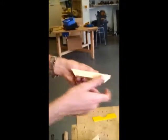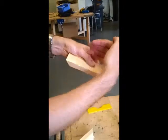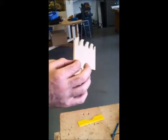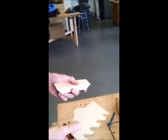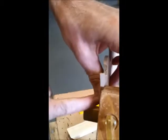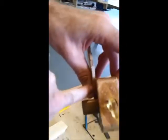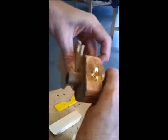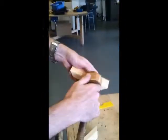We have marked the front here. We now need to know how far back we are going to chisel out. We need to go back the distance of this MDF, which is 4mm. There are a number of techniques we could do. One option is to use our old friend the marking gauge. We can set that needle so that it is hitting the end of the MDF there, and that is 4mm.